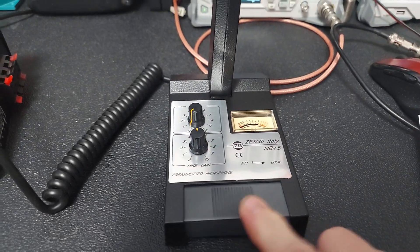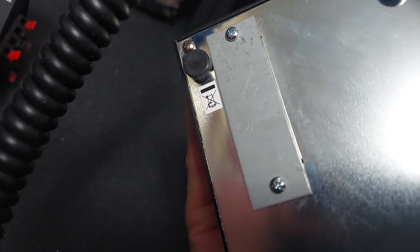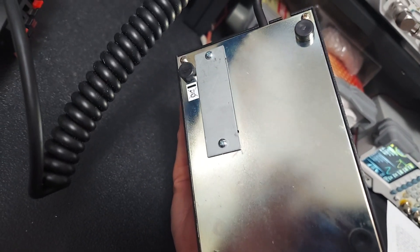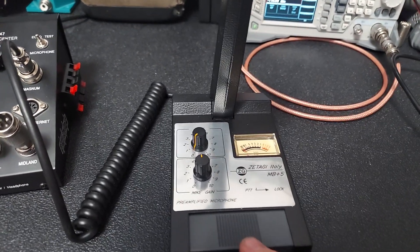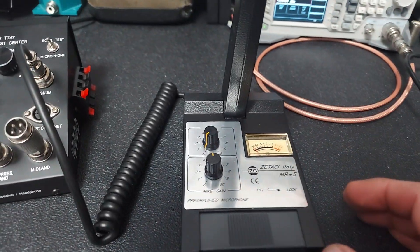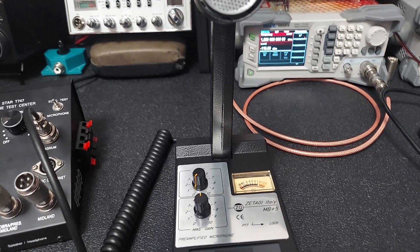When you're done, just press the PTT and slide it over with your finger and it unkeys. On the bottom there's a little spot for a battery. It's easier to take all four screws out, put the battery in yourself, and put the bottom plate back on. I've already put a brand new battery in here for you, Mr. Lee, so you'll be all set. Just don't forget and leave the PTT lock engaged — it will drain the battery. As long as you don't leave the PTT lock on, you should be fine.